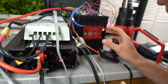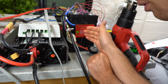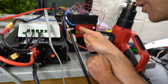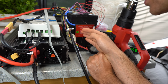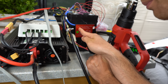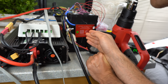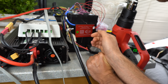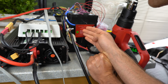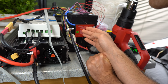For just testing it works great, but keep that in mind. After about 30 minutes of pulling 55 amps through this BMS it's pretty warm. If you're trying to pull 50 amps, get the 60 amp model — but you should have some headroom. Do not pull a full 60 amps continuously through the 60 amp version. Even though it's rated for it, step it down a bit so it doesn't overheat, because earlier at lower loads it wasn't getting hot at all.